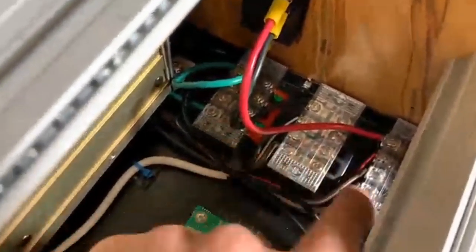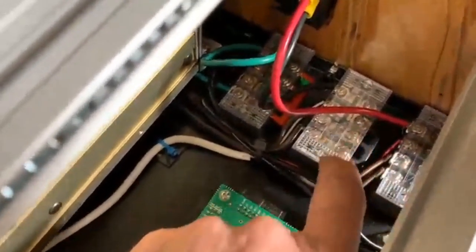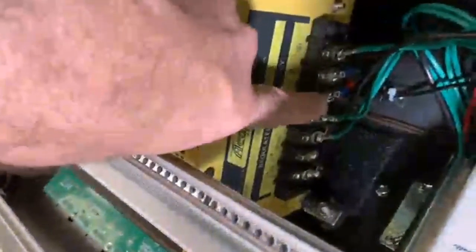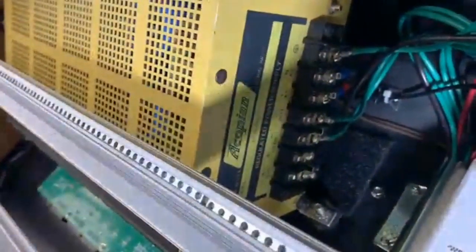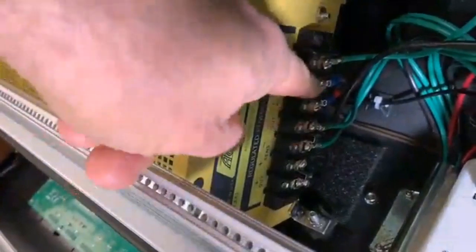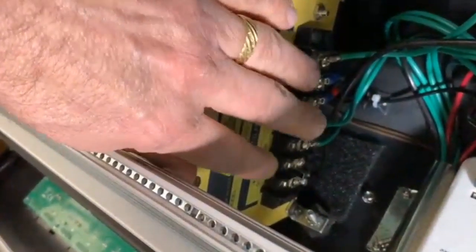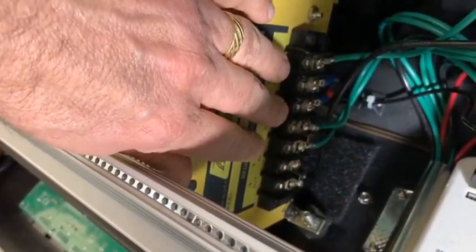The mains down here do have these insulators over the sleeves, although there's one spot where I can get something there. I have plastic covers over my distribution of my mains voltages here, so I cannot get into those. And the bus bars going between them also have plastic insulation. The last step would be eventually putting electrical tape over these screws, just to make sure I don't do something stupid or that dropping a screw in here doesn't short something out. They're exposed right now in case I need to get in and fix or troubleshoot something, but eventually these will be covered.